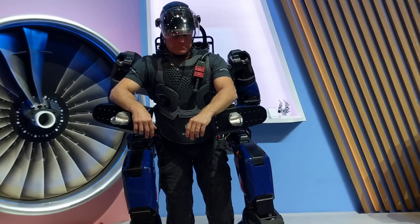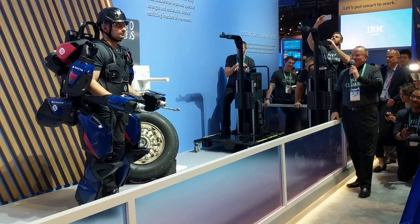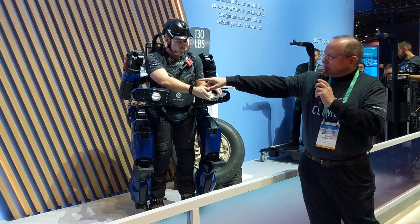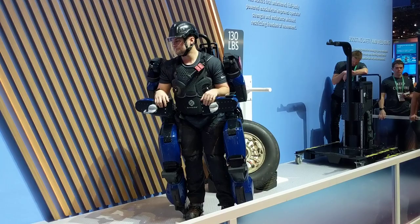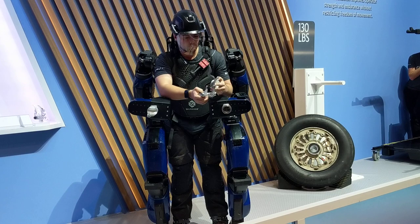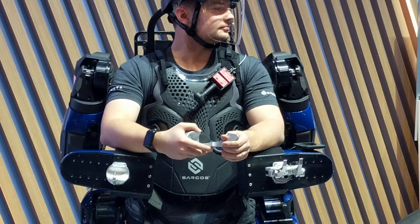So thank you, Jim. Now we're going to let Jim rest for a moment. I'm going to talk for Fletcher. Fletcher has now become an expert at management watching Jim do his work. We talked a little bit about end effectors — notice we're both using the multi-purpose tool. Over here we do have what look like two robot hands. Those are end effectors that can be swapped in. For these tasks, we found that these multi-purpose tools have been the best. Fletcher will walk over and grab and show you these end effectors — it has two fingers, and we're able to position those to do different tasks. These are the end effectors we would use if we're lifting luggage, which is one of our normal demos.